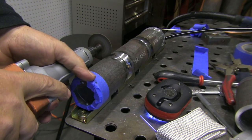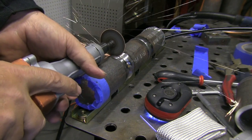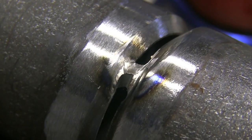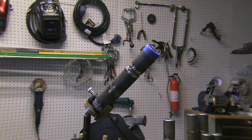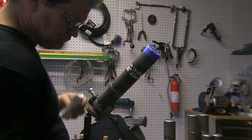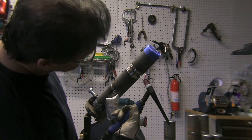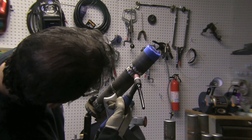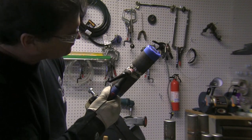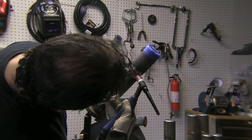Now the inspectors are all different — they might require you to feather all your tacks. I'm just feathering my top one here, and in fact it's a good idea to cut it out when I get to the top. I'm going to cut the side tacks out as I get to them, because I'm going to try to really push rod in the bottom to get a little bit of protrusion and reinforcement up in there — and when I get to the tack it's going to wind up with a low place unless I cut the tack out or feed rod from inside, which is a whole other skill, especially if the gap closes up on you.